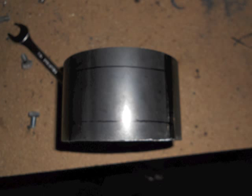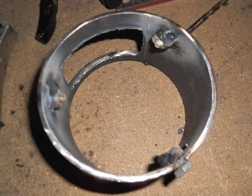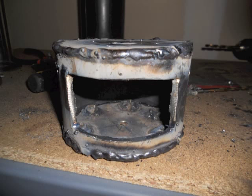Next, take that piece of 4-inch tubing and draw a rectangle on it that's about 1/4 of the entire circumference, then cut this hole out — you want about a half-inch gap from the top to the bottom. You're also going to need your flame tube to bolt onto here, so make 3 holes for the bolts, put the nuts on, and weld them on the inside. Now take the 4-inch circle with the 4 holes in it and weld it onto the top of this tube — this is going to be where your heat exchanger bolts. Then weld the disc with the 6 holes onto the bottom, and take careful planning to make sure the opening on the 4-inch tube lines up with the intake of your combustion chamber, which is where all the air is coming out of the compressor.